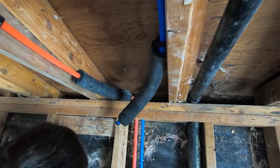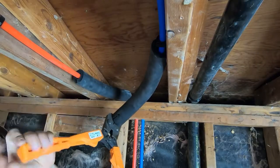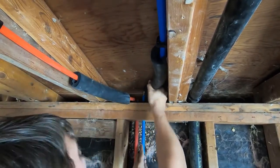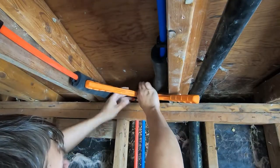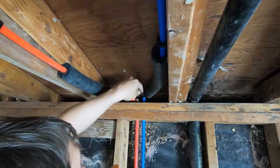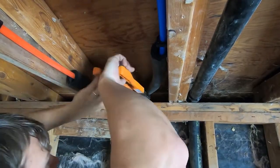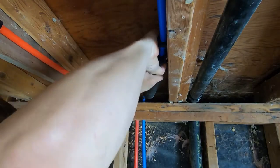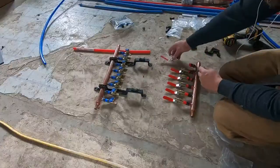I'm also going to use pipe insulation all throughout the walls. I used PEX type B because about 12 years ago I bought that crimper tool. PEX type A is so much better — with PEX A you use a drill-like tool to expand the pipe and then put the pipe on the fitting. With PEX B you have to put the fitting in place with copper rings and then squeeze the rings. Having to squeeze those rings between the rafters was a tight fit and sometimes a real pain — I got some hurt arms doing this work. Whereas with PEX A you can bring the pipe down below, widen it with your tool, fit it onto the fitting, and it works great.